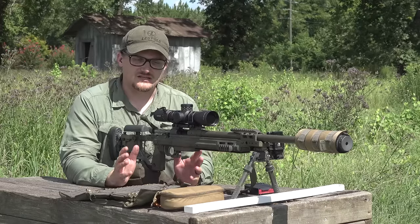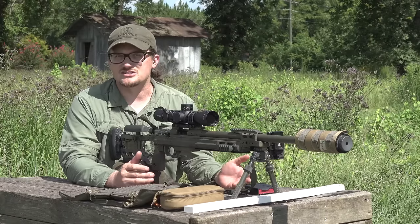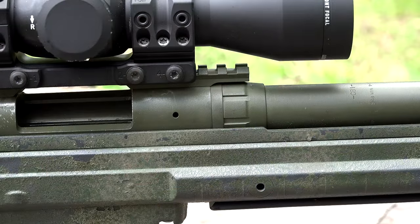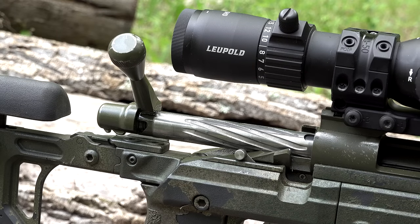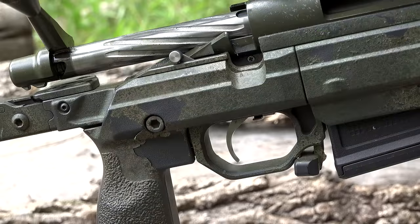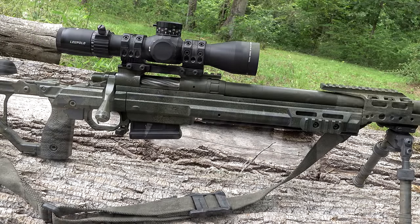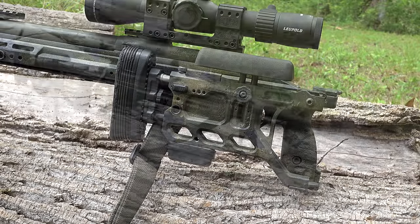So I just decided I'm going to have Ray take this gun. I'm going to have him true the action up. I'm just going to drop a Criterion barrel on it. So I bought a Criterion Remage style barrel. I had Ray at Moss, our gunsmith we've been working with for years, cut the barrel back and thread it for me at 20 inches, since I wanted a nice compact setup. He trued up the action. I dropped a PT&G one-piece bolt assembly in it. It's got a Jewell trigger in it now, and I've run this KRG chassis system. This is a little bit older generation Whiskey 3 with the folding mech and everything. And Ryan up there, the apprentice gunsmith at the time, Cerakoted the whole rig for me.